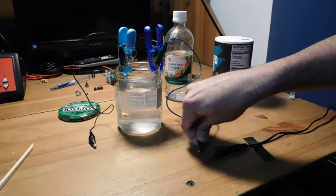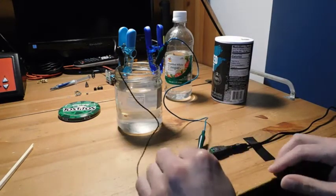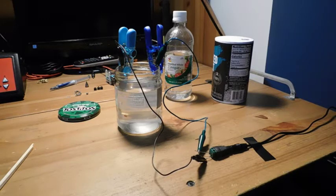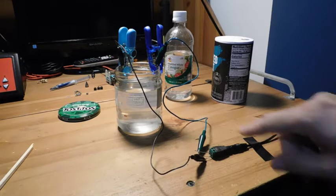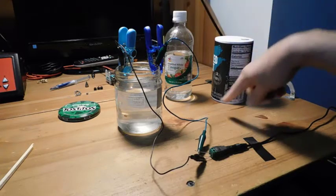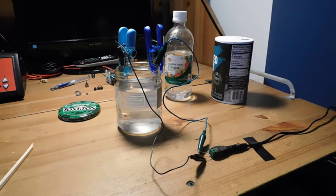I'm going to take this alligator clip and connect it to the positive end, and take the black one and connect it to the negative end. For now we just wait. Over time there should be an accumulation of bubbles over on the negative end. This mixture of white vinegar and salt will eventually change color — it'll turn a bluish color. Once that happens, after I let it go for a few hours, the electroplating solution should basically be ready. We'll have nickel ions floating in the solution, and then we're going to connect one of these electrodes over to the battery terminals to transfer the nickel onto them and get them all ready.